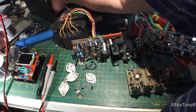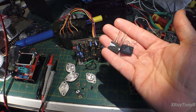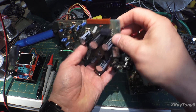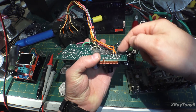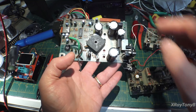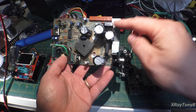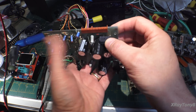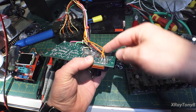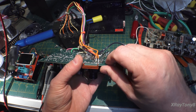Gone are those ganged-up bridge rectifiers. If you remember, there was one on the front and they bodged another one on the back, and these wires were shorting out. I took them out — they're rated at 2 amps. So I put an actual 4 amp bridge rectifier. I had to open the holes a little bit bigger, then I put clear heat shrink on these and properly wired them onto the pins so they won't short to anything.